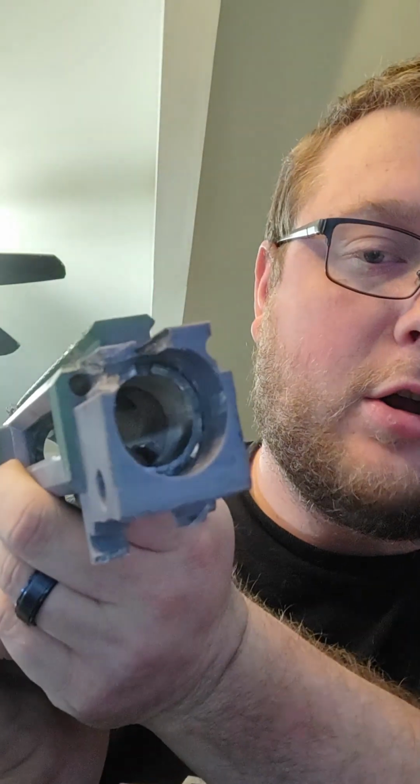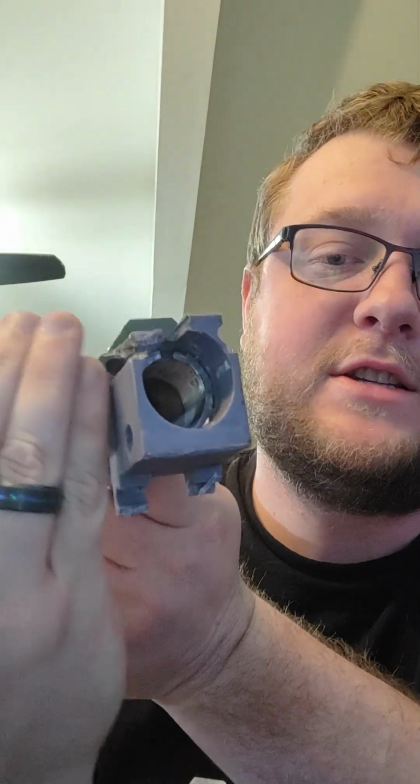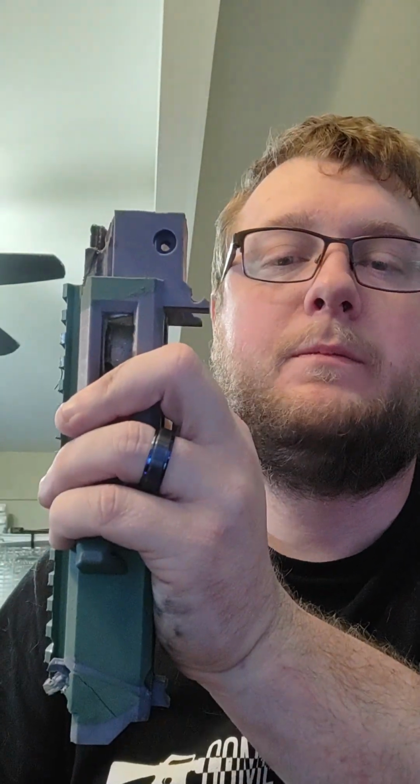The handguard will have to be reworked. I'm going to have to make some cavities kind of in this area, maybe bulge it out a little bit, I don't know yet, in order to accept that. So there'll definitely be some rework. On the bright side, as you can see, our aluminum tube that actually mounts our barrel is recessed a fair bit into this printed area, and that is just so that the cross pins through the plastic can be mounted. Clearly that is an inferior system, and I have another design in the works right now that was going to reuse that same system in a .308 caliber, so that is going to be scrapped as well and reworked. Not the whole design, but that part of the design will be reworked.